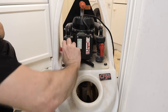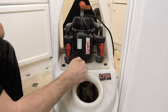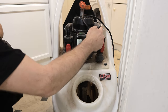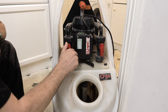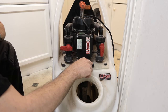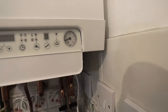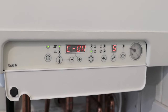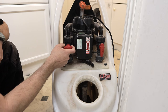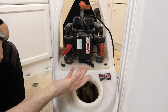This is recirculating, this is dumping water. You can dump water in the other direction too — put the reversible flow valve into the other direction, push water through the system that way, and dump water with the other valve. The valves also have an off position — nothing happens. If you put one valve pushing into the system but the other valve is shut, the machine will be building up pressure in the system, which is very useful if you have to fire the boiler when the pressure switch won't make because pressure is below 0.5 bar. Close the valve, build the pressure up, fire the boiler, then slowly adjust that valve to maintain the pressure.